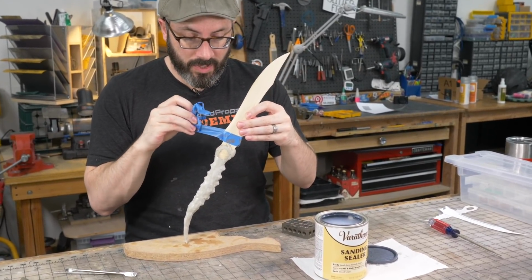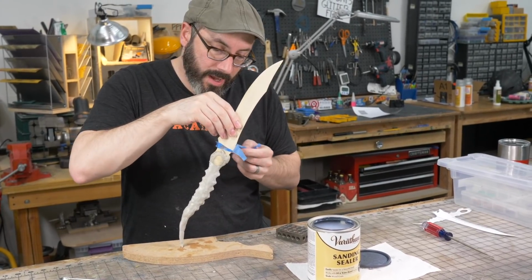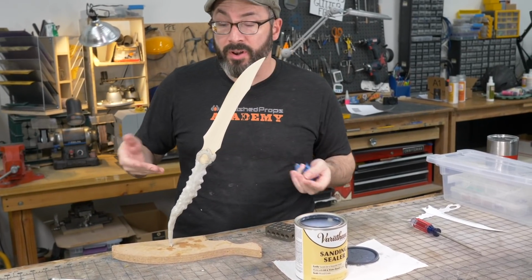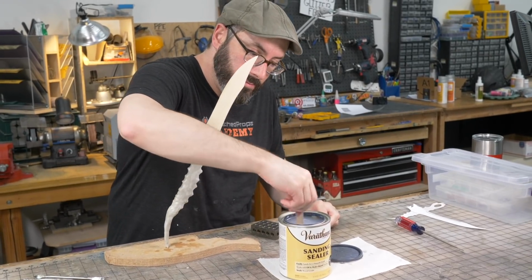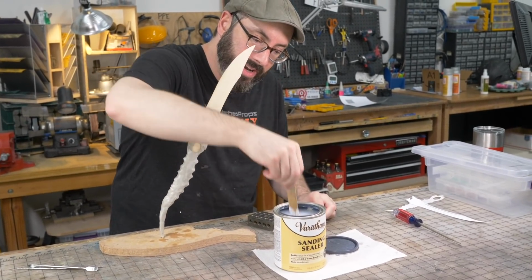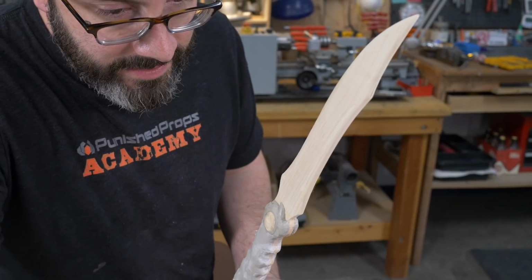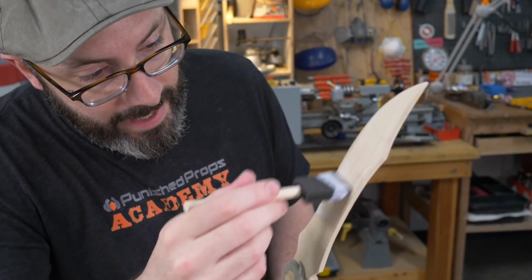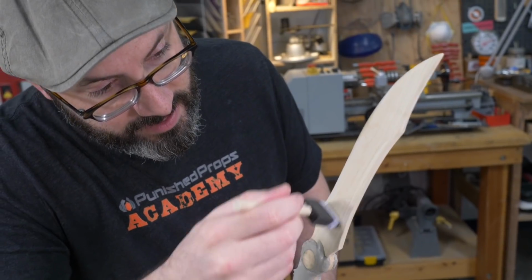I know it's something woodworkers will use to make the wood grain less pronounced. So I'm gonna put a layer of that on there. It takes an hour to dry, so I figure might as well put it on there and let that dry overnight as well. Just gonna mix it up. Oh yeah, that's separated. I gotta do a lot of mixing. So I guess this stuff is supposed to help solidify the outer layer of wood so that when you sand it, it sands nice and smooth.